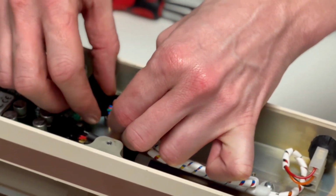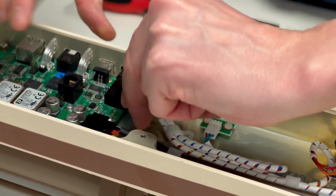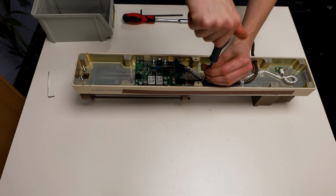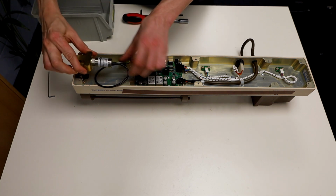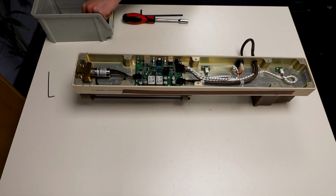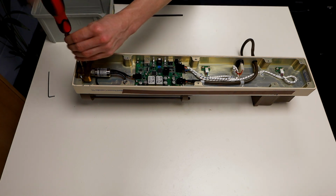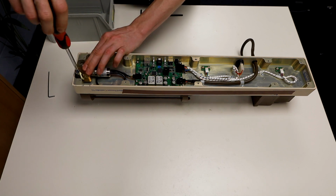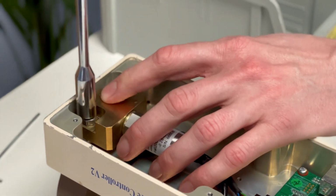Re-plug in all the loose cables to their relevant sockets and screw in the strain relief clips. Place the transducer de-airing block back into its section, re-plug in the PCB cable and screw back in all the outer nuts using a 10mm deep socket. Ensure the transducer block is flat by sequentially tightening the two nuts.